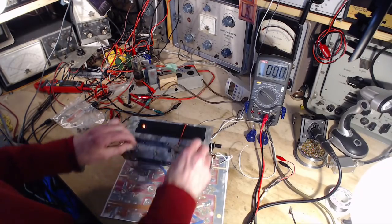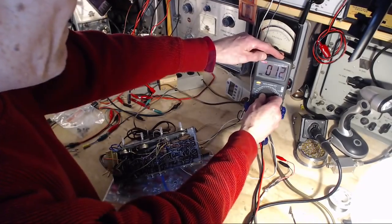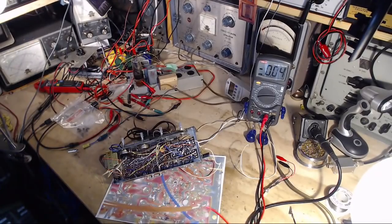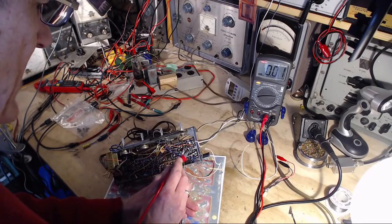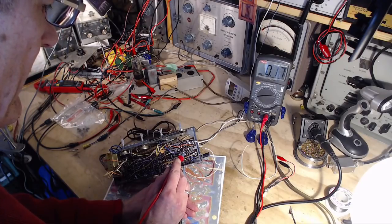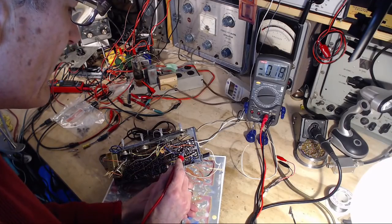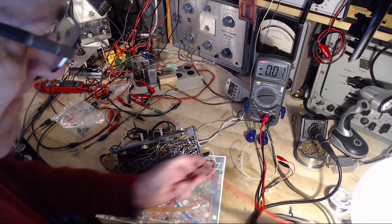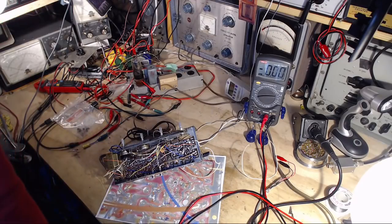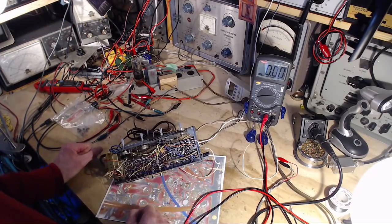Let's check the voltage of that one pin with the meter. Voltage was supposed to be 2.4, but it tests at zero. Is it any different? Checking right here. 1.35 now. Is that right? No, it was this one. It's this one. Still zero. Okay, so we know it was not that transistor. Radio seems to have a little more oomph in it now, so maybe the new one I put in is actually a little better. Looks like we're still missing the local oscillator.